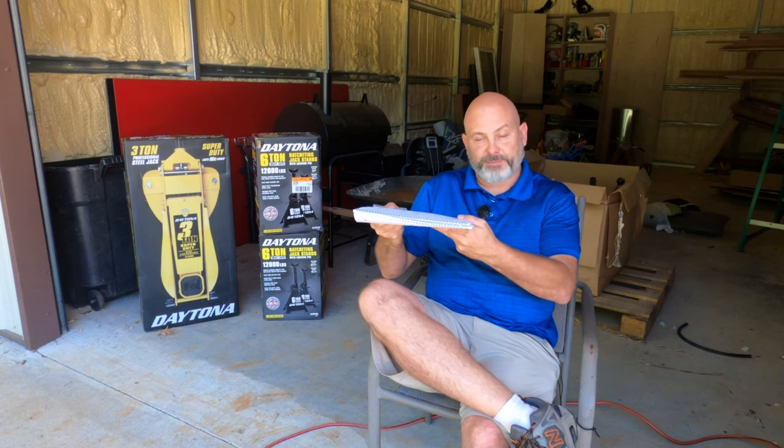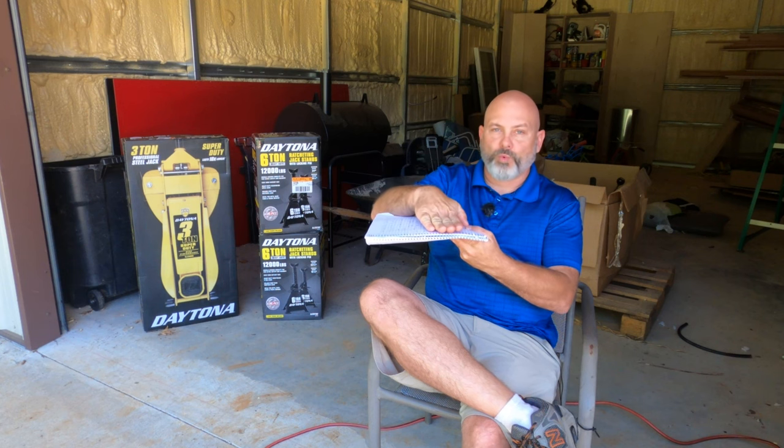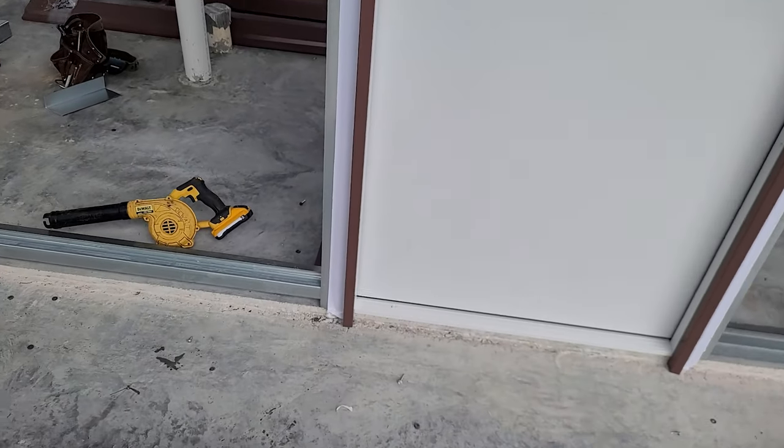If I were doing this again, the first thing I would do is get the double-sided tape around the bottom — all the way around the perimeter on the hat channel, and then one more layer of hat channel up from the floor. You're also going to want to get the double-sided tape around all your doors and windows. Leave the backing paper on the tape to protect the adhesive so it has maximum adhesion to the insulation. On the gable ends, tape every single piece of hat channel — I'll explain why later.